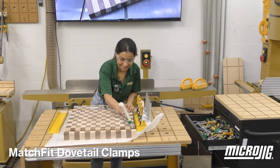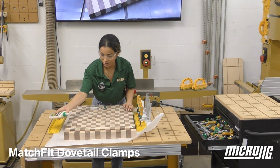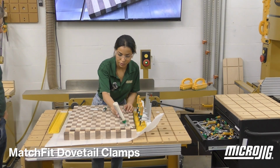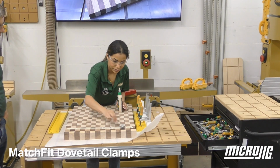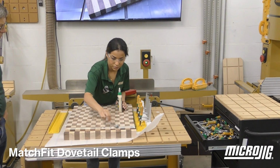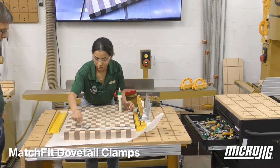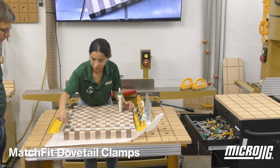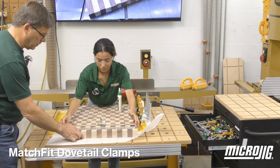Okay. So last time we did like 2 strips of glue. Yeah, and on the first one you may have to add a little more glue because some of it's going to stick on the roller. Got it. And these are end grains, so normally you would be worried about them absorbing a little more than normal glue. But these are walnut and maple, so they're pretty tight grain. There's not a lot of pores on these where they're at. All right, good. Yep, right up against this one.